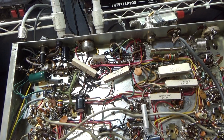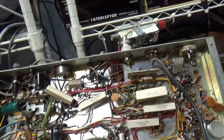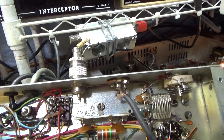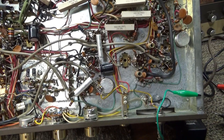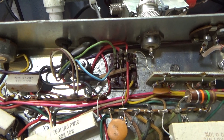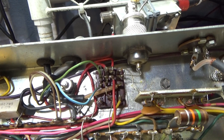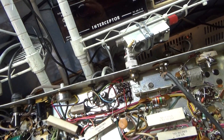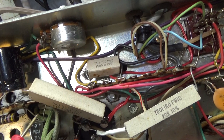This video shows how to test it with the radio powered up. You don't need a receiver hooked to it — I hooked a dummy load to it because when I key it down I don't want a bad match taking out something else. You'll need a mic or something to actually key it up. I have a foot switch, so I'll key down with that and you can hear the relay kicking in.